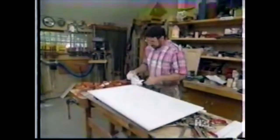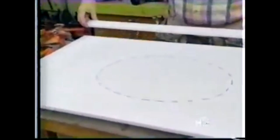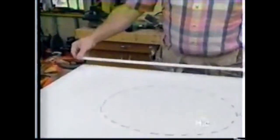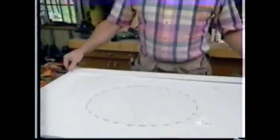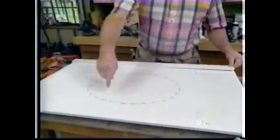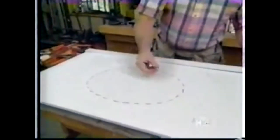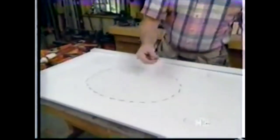Now I've turned the countertop blank upside down and raised it up on some blocks of wood, and taken some pieces that I've ripped, which I'm going to put around the edge to make it look like it's 1 inch thick. I've also put an outline of my sink area, so I'll know where to put adhesive, because I'm going to build that up so that when it's cut out, it'll appear to be 1 inch thick.